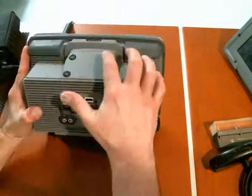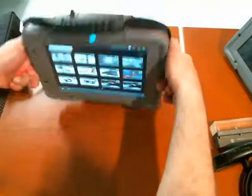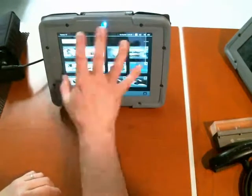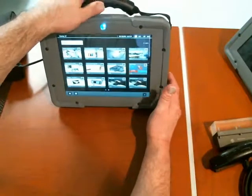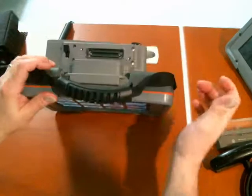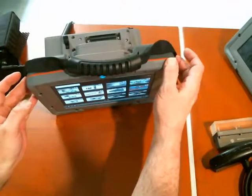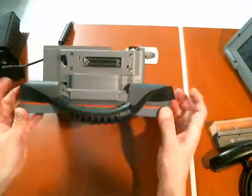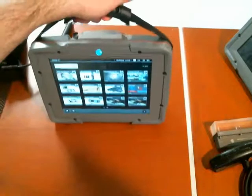The multiplexer housing has a tilted base and feet so that the instrument sits nicely on a benchtop, tilted back at a good viewing angle for operation. Because the kickstand is no longer required, we have a handle kit available to make this easier to transport. The handle kit comes with the appropriate Allen wrench tool to loosen the captive screws on the kickstand. Take the kickstand off, put the handle on with the same tool, and you have a convenient carry handle to transport the instrument.